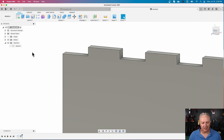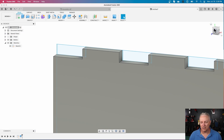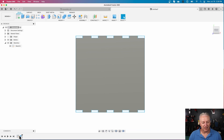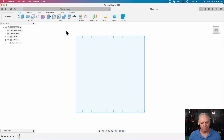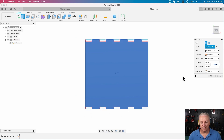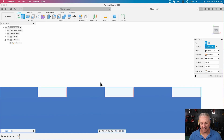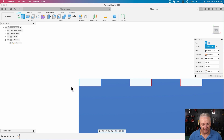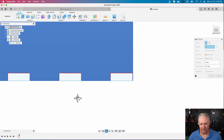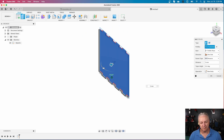Going back to the 3D shape, I'll turn on the sketch to overlay it — you can see those kerf rectangles I drew. I'll delete the previous extrusion because there's an easier way: I can select everything and extrude at three millimeters, then unselect the large pieces where the finger joint's other half will go. Unselecting the unwanted thin pieces gives us a three-millimeter piece of plywood with properly cut finger joints.